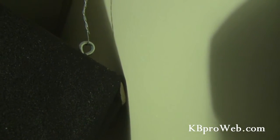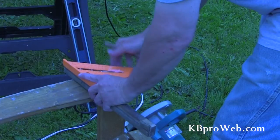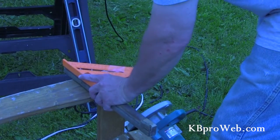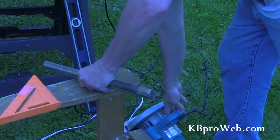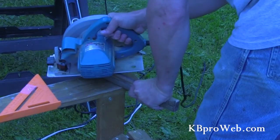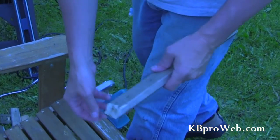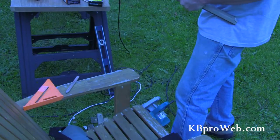Here's an important part: when you hang your panels into ceiling corners, you have to cut your one-by-twos at an angle on the ends so they fit nice and snug against both the wall and the ceiling. You can see how the end is cut at an angle. To do that, simply take your one-by-twos after they're cut to length and cut off a 45-degree angle. Sand those down and you're good to go.